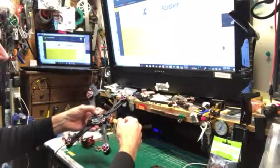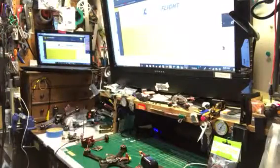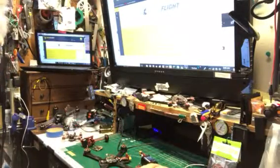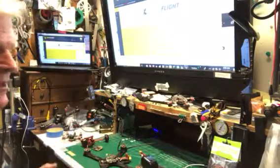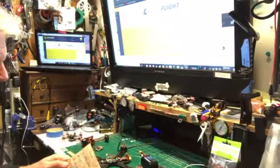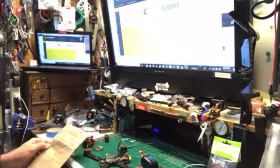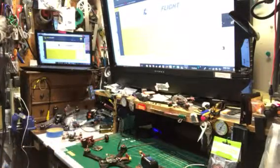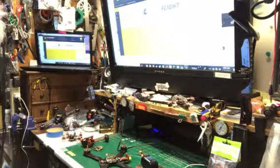It did at one time spin the motors and got that all set up. But then as soon as I checked the serial ports, it canceled everything. There's no documentation, no instructions, no UART identification unless you dig something up. It just says you can put a GPS but doesn't identify the UART. It did spin the motors and hook up in Betaflight, but there's nothing in the way of Crossfire protocol out there on this.